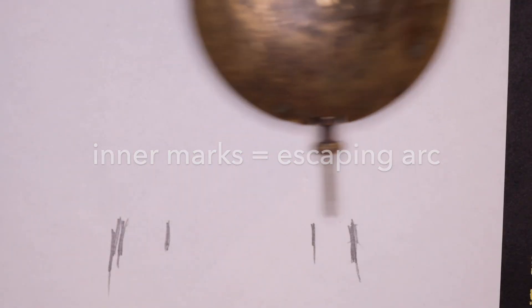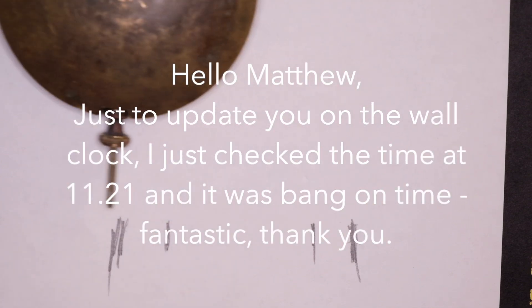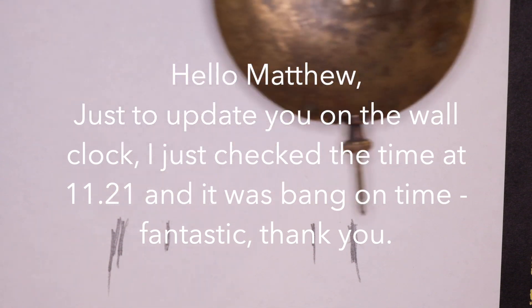I hope that was of use. Next time you have one of these clocks on the bench with an older mainspring, unless it's actually cracked — and you can see cracks under low-power magnification — my plea is to wash it, grease it, try it, and see how it goes. You can see the clock here is running with good supplementary arc, and my client after a couple of weeks said the clock is keeping great time. A challenge: don't build our practice on rules of thumb, but constantly question and interrogate.